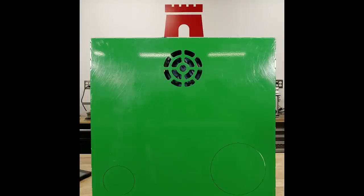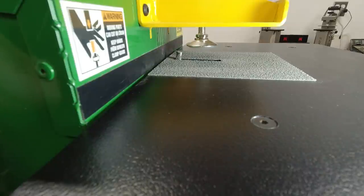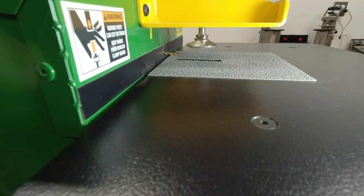Using dust control with the TSM-12 will keep the routers clean, cool, and ultimately increase their longevity. Here is a close-up view of the pocket cutting action. As we push the pocket lever forward, a router bit comes up out of the table — that's what cuts the pocket. When we pull the pocket lever back, the drill bit comes forward and that's what drills the pilot hole.